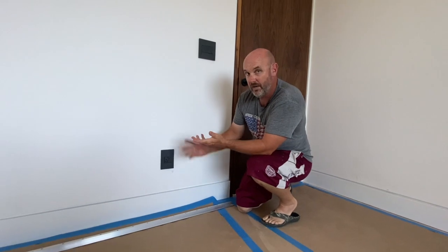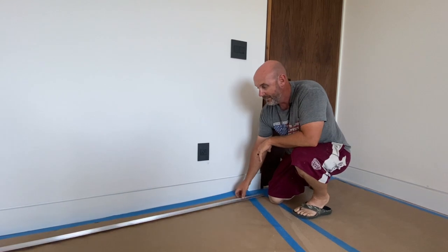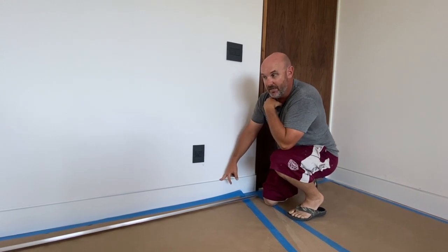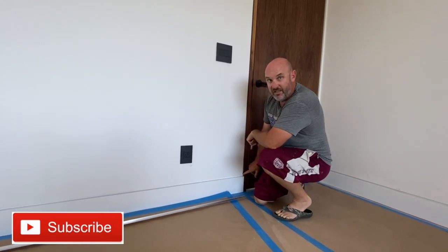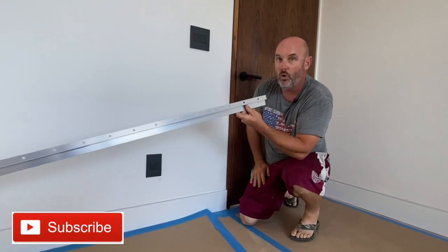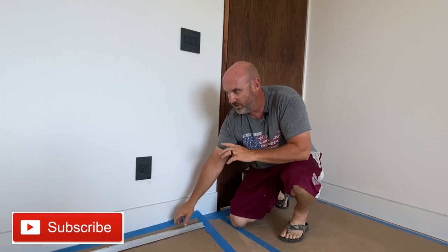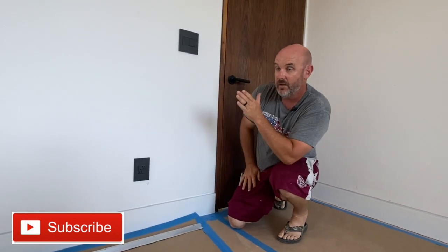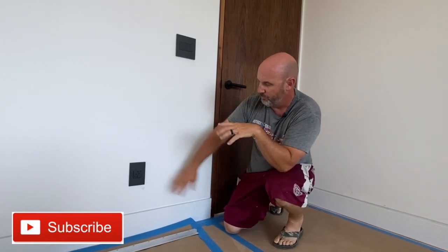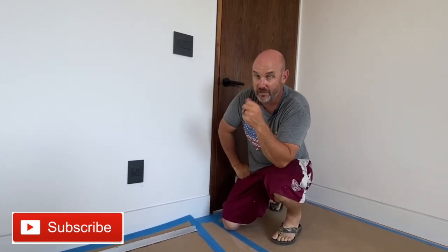Normally on sheetrock work, that bottom edge doesn't matter — your trim covers it up, they don't have to finish that. So this adds a whole bunch of work for the drywall guy, because now he's got a mud seam at the bottom edge. But after he's done, me and my guys — your trim carpenter — has to come around and make very nice tight miters at every corner all the way around the house. So this is almost like a whole second set of trimming out. But it allows you to do this really cool effect where everything's flush. You don't have trim sticking out from the wall. And that shadow reveal at different times of day — you just paint it with the wall, white or whatever color — it can just be the coolest effect you can imagine.